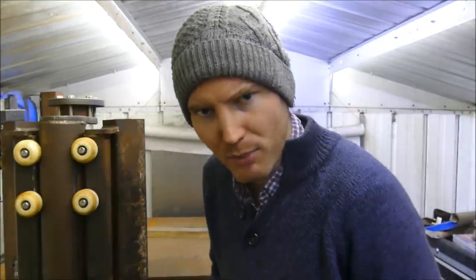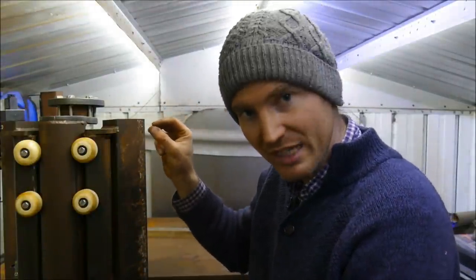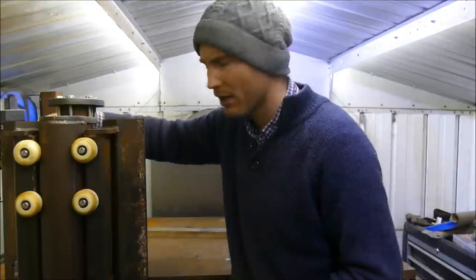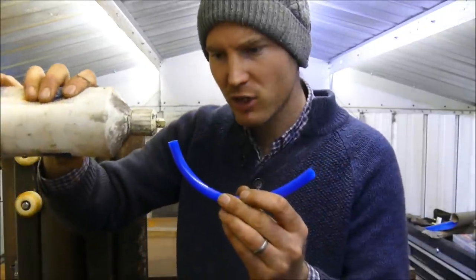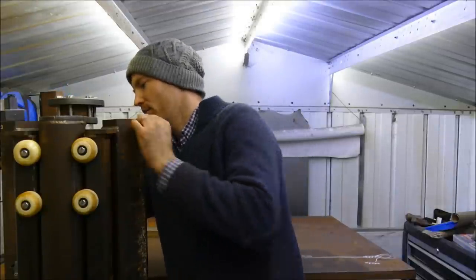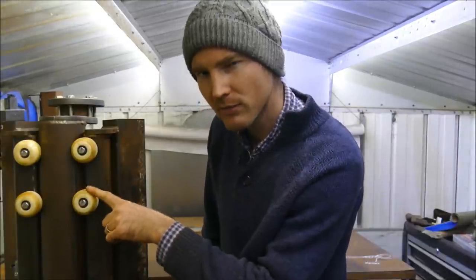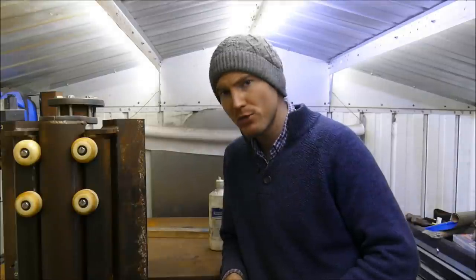Also, as someone is probably about to point out, I should still oil the cylinder and protect the seals within it. And that's okay because I now oil it like a regular compressor tool. I simply pull out a pipe, it might be pre-pressurized. There we go, take it off, as simple as that. Get my special compressor oil, put in a few drops, and stick it back in. There you go, I've oiled it and it's fine. These though, they don't need oiling, and I like that. Nice grease-proof clean area.